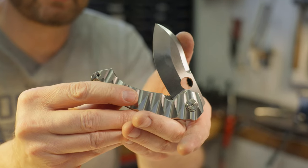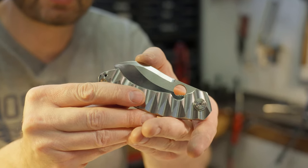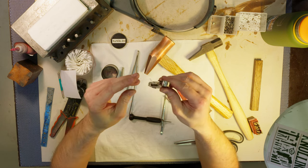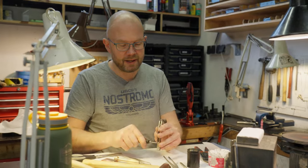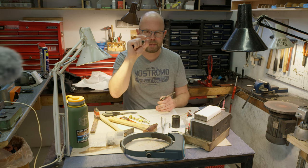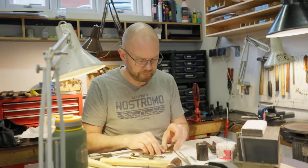This feels good and it sounds good, so the detent is set perfectly. When I close the blade, at some point the detent will drag the blade shut, which keeps it from opening up. The level of success I feel when everything just goes together — it's like, oh, it feels so good. Even though I've been doing this for so many years there's always that tiny bit of doubt whether I was actually able to pull it off, and when everything just works as planned, the justification is just so satisfying.